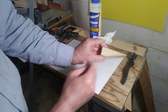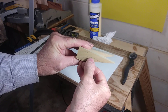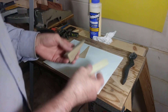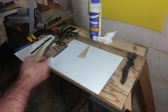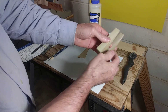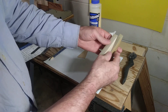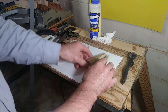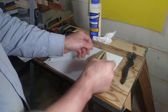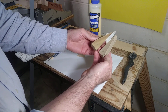What I did do is make a little pencil mark — can you see that? See how that's like the neck coming down, going into the heel and turning down? I've got it drawn on the other side as well. Because when you're getting ready to glue up a neck, the last thing you want is to put glue on the wrong side and end up gluing them incorrectly — and you don't find out until it's dry. So my identifiers: if those are the two pieces, I make an X and then circle it. Anytime I have an X and a circle, I know I want those two parts to glue together.